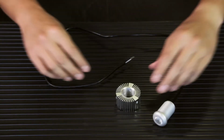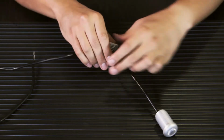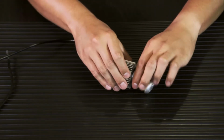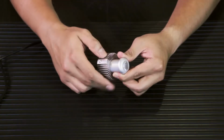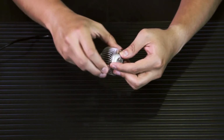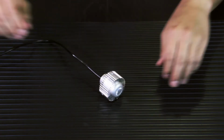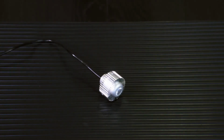When it comes to heat sinking, the user should always remember to screw the heatsink on all the way so that it's flush with the lens cap. This is the most crucial point as it is closest to the LED junction from which the heat is originating. We also recommend that for the classically threaded light plugs, the threads should be completely or mostly covered by heatsink.